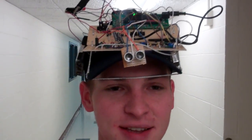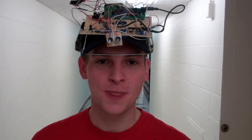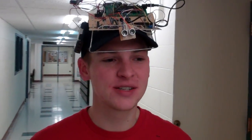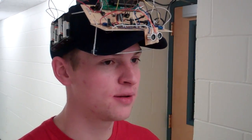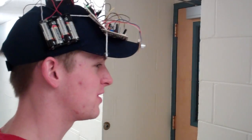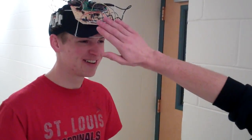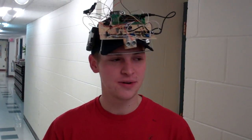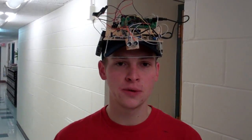so it'll vibrate when you're close to things. I'm looking at the ultrasonic sensor right in the front here, and there's a motor inside the front of the hat that vibrates when you get close. Right now your camera's vibrating the motor. The whole idea was to give people who are vision impaired a good way to navigate around without the need for canes. You can detect a wall — you've got about six feet range, a 60-degree cone, and the vibration in the hat ramps up the closer you get to the obstacle.